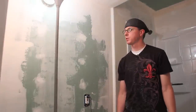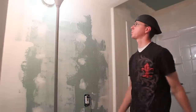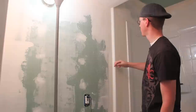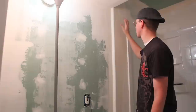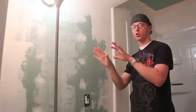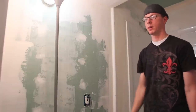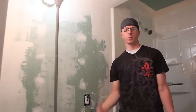As you can see, we've now done stage two of mudding and taping. I've got a pretty well applied, evened-out layer of mud. I've got some spots at the corner where there's some dimpling inside the little holes in the corner piece, so I'm going to want to hit that with another coat — that tends to suck in on the first coat when wet, and a second coat should take care of it. The objective of this coat is really just to smooth things out and get any joints or butts next to each other smoothed over so you can't tell there are any joints — it just looks like one solid piece. We'll move on to the next step as soon as this is dry: coat number three.